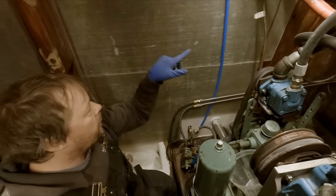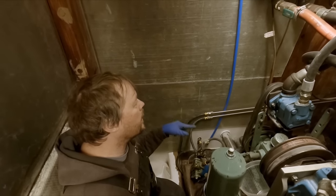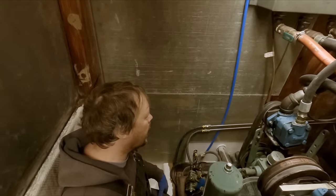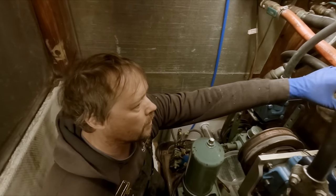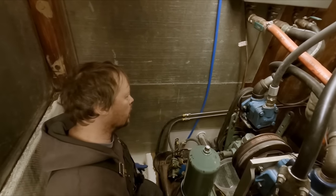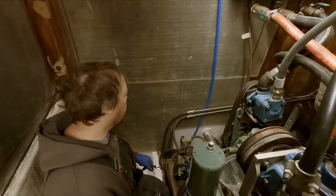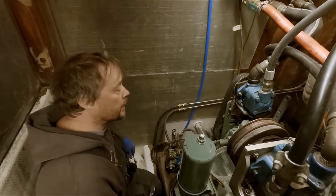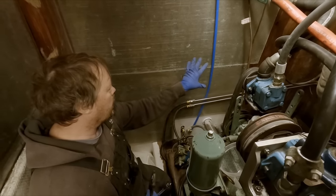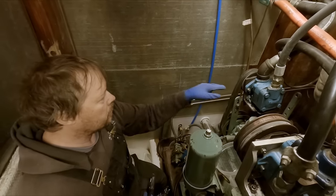Somebody asked me if the new hydraulic tank would be hard plumbed in with piping and no hose. Yes and no. The manifold will be stainless steel. Our valves will come off of that. Then it needs to go into hose to allow vibration. If you plumb that in solid, you can crack welds and stuff over time. All metal will work harden under vibration, and then you get failure points in it. So probably have a short hose between the tank and the metal manifold, and then hose going to the pumps.